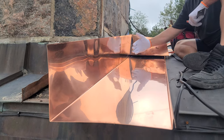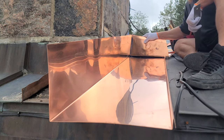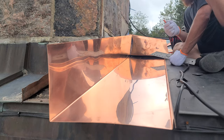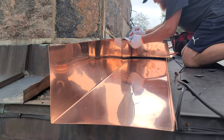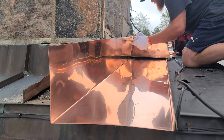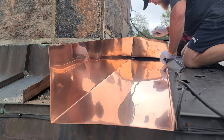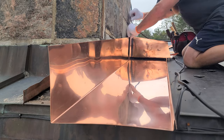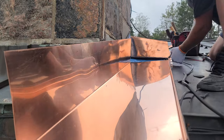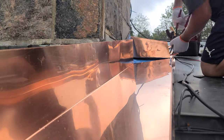This panel is my chimney side panel, so what I'm working on right now is connecting this top corner to the back pan. The way we do that is with a sweeping detail — a sweep detail coming off of here. I'm using the back pan and the step-off method to get my miter line on the top edge of this. You'll notice how much material is sticking off the edge — that is because I have allowed enough material to return. That is something to consider when measuring the length of this panel: always keep in mind that the flange returning up must be accounted for and needs to match the height of the back pan.